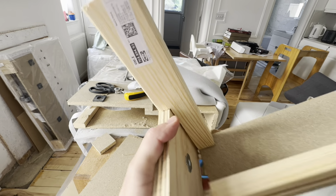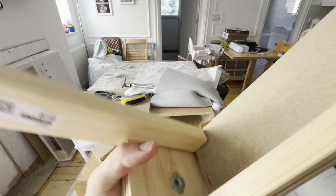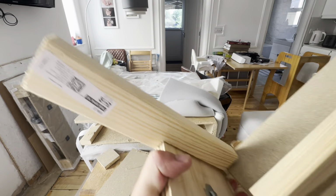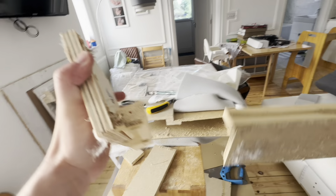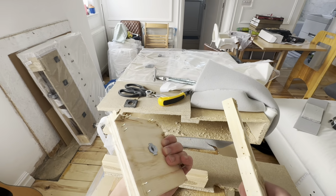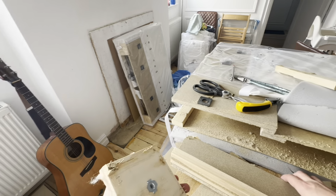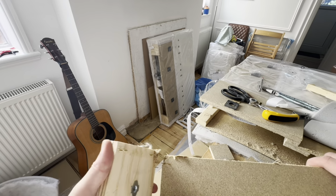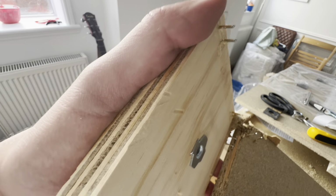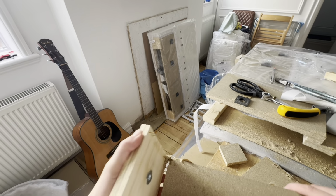Now, unfortunately, it has come away from the base, which we didn't want, but it's not a problem because, as you can see, once we wiggle this loose, like a goose, ta-da, we can get rid of the part that we were trying to. We'll have to remove these staples, but then the old staples provide a bit of a location pin, so to speak, for putting this back in, and then we can reinforce it with a screw, and we are good to go.